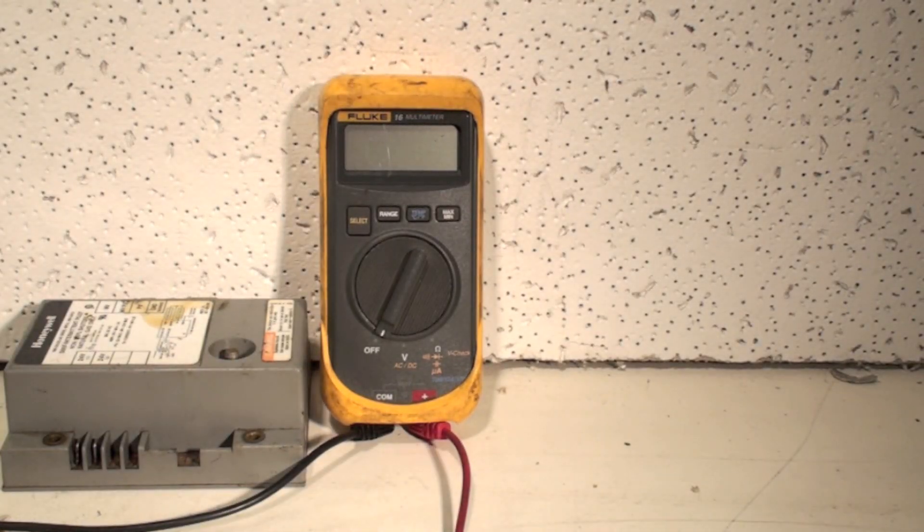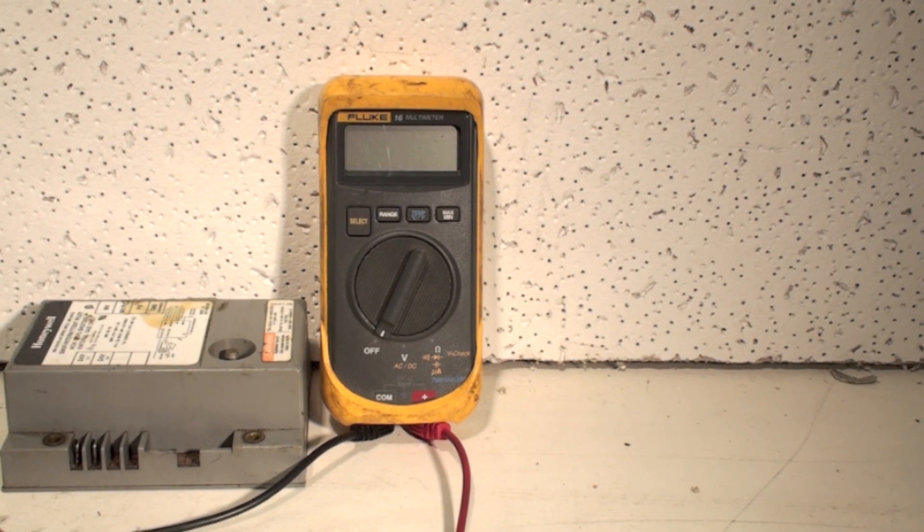This is about the use of the multimeter. A multimeter is pretty much anything that has more than one use. Multimeters almost all do voltage — AC and DC — and ohms. Some do amps, microamps, and so on. This one does most things I would need. It's the Fluke 16. They don't make it anymore; the replacement is the Fluke 116, which is an RMS meter, meaning it's a little more accurate.